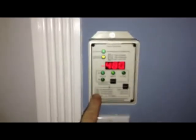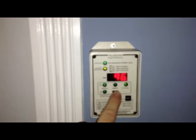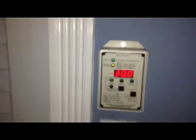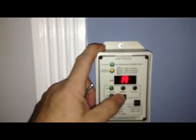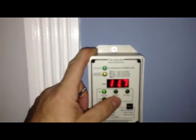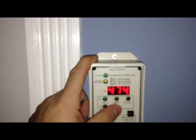I'm keeping this down to the critical loads — we're just under 500 watts. My battery monitor, the Trimetric, is showing 96%. It's a 700 amp hour battery bank and we've run off about 30 amp hours. Battery voltage is being pulled down by the load — resting is probably more like 12.6. That's our current load.